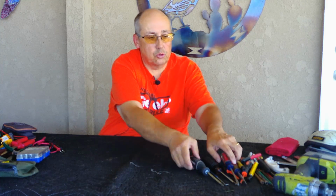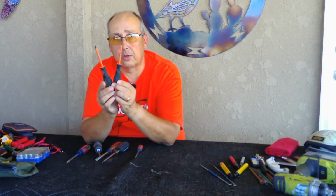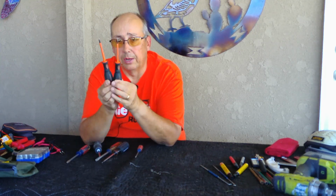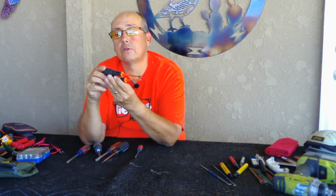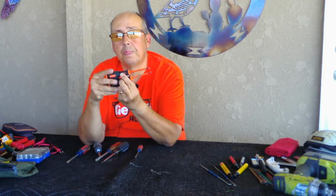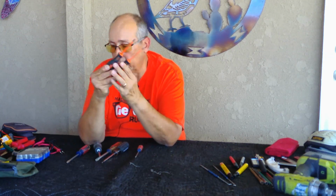Okay, so here we go, some screwdrivers that I carry. You don't need a big giant set of screwdrivers. So here's what I have. Specialty screwdrivers. I use these for working in load centers. Phillips and slotted #1 size. These are rated to 1,000 volts. So 1,000 volt protection right here. I bought the whole set. I think there's 6 or 8 of them in there. I never use the big ones. I only use these little ones because that's all the RVs have, is just the small ones.